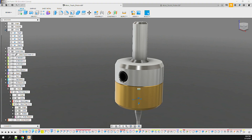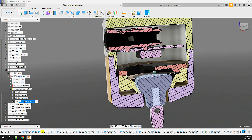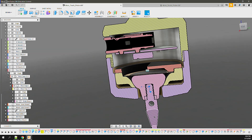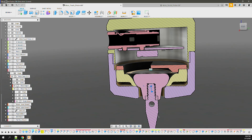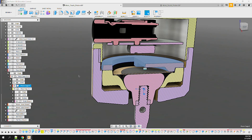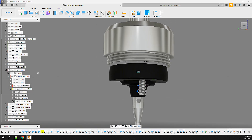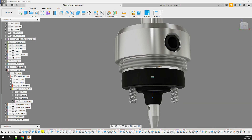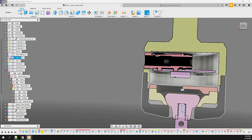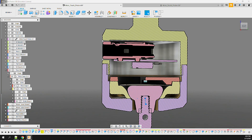Ultimately I landed on a solution. The piezo tray was converted into a piezo rack consisting of: the probe mount - basically a ball head with a flattened top that the probe screws into; the probe tray - a ball socket for the probe mount, which allows the probe to seat and swivel about 15 degrees in any direction. Pressure from the piezo keeps it biased to center. The piezo sits in the tray and a cage cap retains the piezo on the stack, applying slight pressure to the probe surface. Together, this probe rack interfaces the probe to the piezo without glue to provide a highly sensitive engagement. The entire rack can be trammed using the grub screws and the nose of the body. A laser-cut foam disc applies pressure between the circuit board and the piezo cage, forcing it down to the nose while allowing about five millimeters of additional movement in the event of a crash.